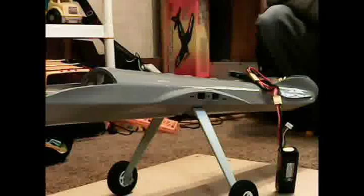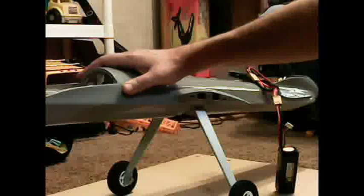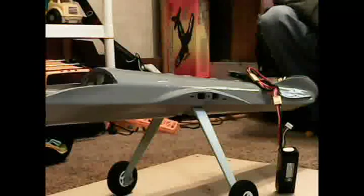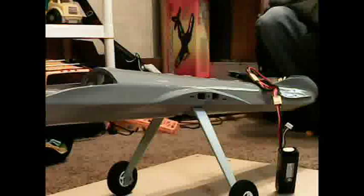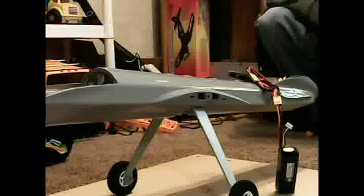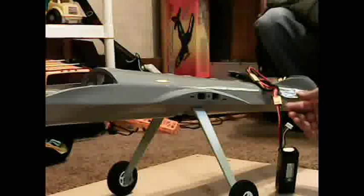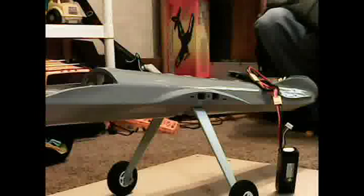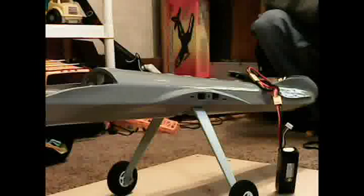I'm going to have to take a little bit off — I was pushing from this side, I can hold it from this side. Try it again — here we go to 75. Yeah, it's too much — 23 amps. 11 by 5, 3-blade. Well, I'd go 11 by 7 — that's going to be too much. This is 10 by 7 now. 11 by 6 would work, because it would be the same as this. I almost hate to say it, but you almost need to go back to a 3-cell. I would put this on a 3-cell — same size, 4 amp-hour, 3-cell.